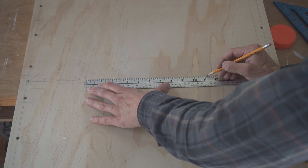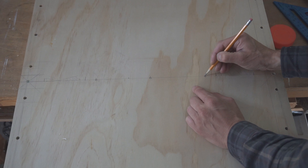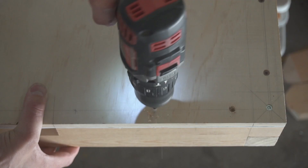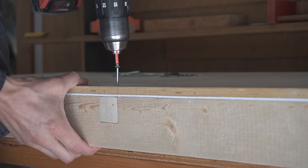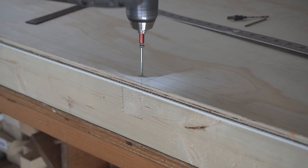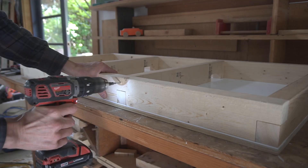I use the puck to help me with the layout and I double and triple checked my measurements before I drilled any holes. I countersink all the holes and use 1-inch screws for the bottom through into the 2x4 and 3-inch screws that go into both of the 2x4s. I use 3-inch screws to secure the side boards.